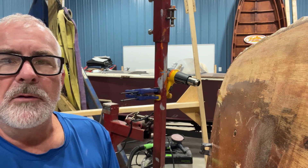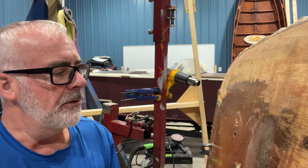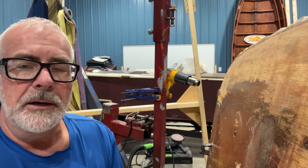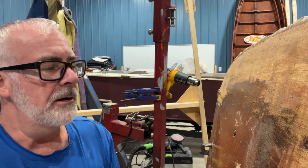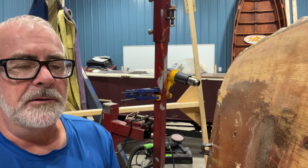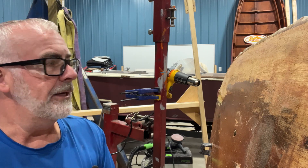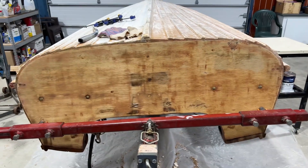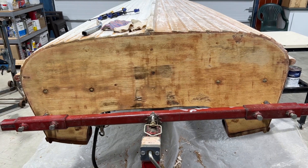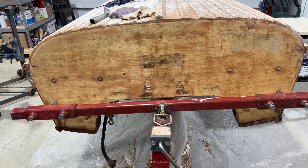I spent 12 hours on the stripping using Total Boat stripper — I did the whole bottom and then half the transom. The experiment is to do the exact same thing on the side using a Wagner heat gun and my scraper from Ace Hardware, to see if that speeds it up and to look at the cost of not having stripper and the time of washing the boat after. Here you can see a comparison side by side: to my left the heat gun, to the right the Total Boat stripper with the same Ace scraper — pretty similar, twice as fast from what I can tell.